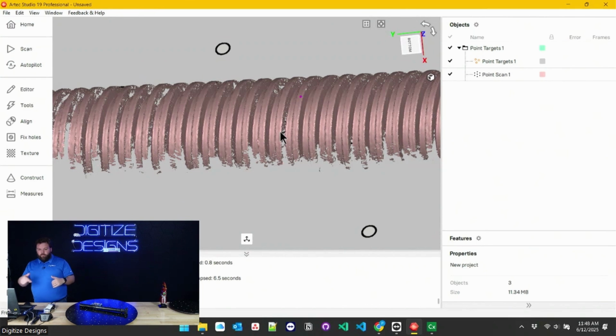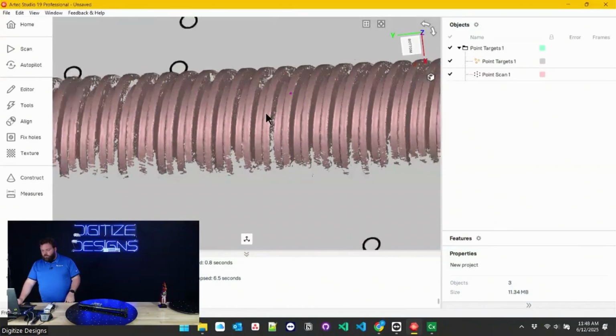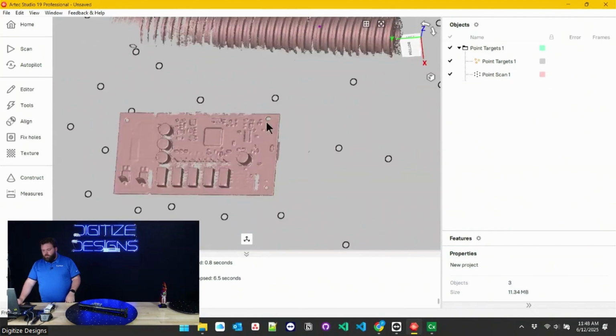You can always get a position. Usually those holes have a chamfer. You're definitely going to get at least a little bit into something. Our rule of thumb is about 1 to 1, however wide the hole is, for how deep you can get. So a quarter inch hole, you can get about a quarter inch deep in that. But yeah, this is ideal. You definitely could reverse engineer those or do some sort of inspection on them.